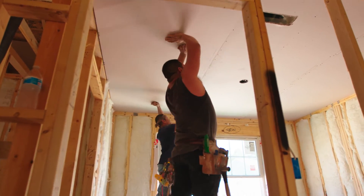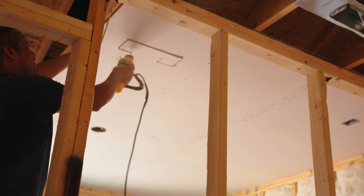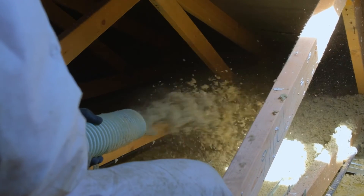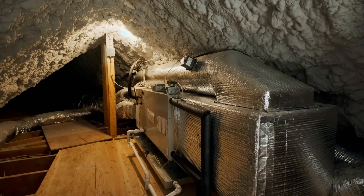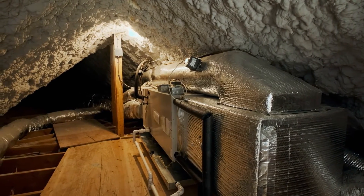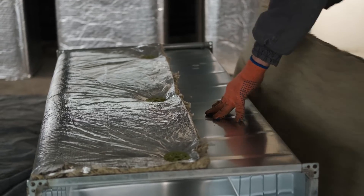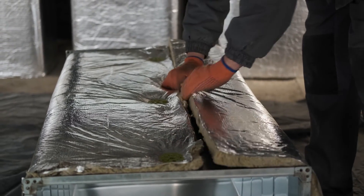For the ceiling, any opening for grills and registers can be marked and cut in the ceiling finish. One also has to consider the type and thickness of the attic insulation that will be going into these areas. If the attic is conditioned and insulated, ductwork may still need to be insulated depending on the code in your area. If ductwork runs in an unconditioned and vented attic, it is required that it be insulated to increase the life expectancy of the system as well as performance.